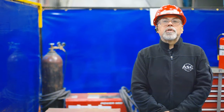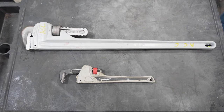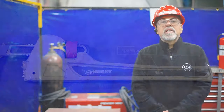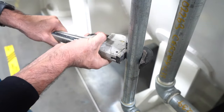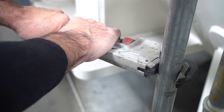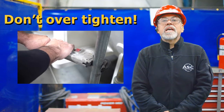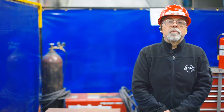The last type of wrench we are going to cover is the pipe wrench or tube wrench. The purpose of a pipe wrench is to grip and turn a soft pipe or round fitting. Do not use a pipe wrench on a hard material because the teeth may break or damage the material. Applying a pipe wrench to a threaded pipe would have a negative result because the teeth would crimp the thread and ruin its ability to screw onto or into another material. Pipe wrenches come in different sizes, normally stamped on the side. They work with the torque you apply — as you begin to turn, the teeth bite down harder for a stronger grip. It is important not to overtighten, as pipe wrenches can apply a large amount of force and you do not want to break or bust the material you are working on.